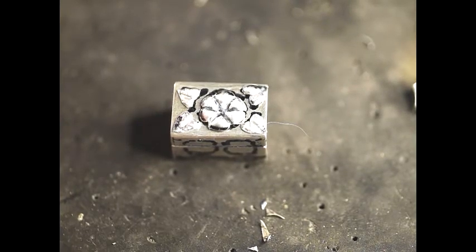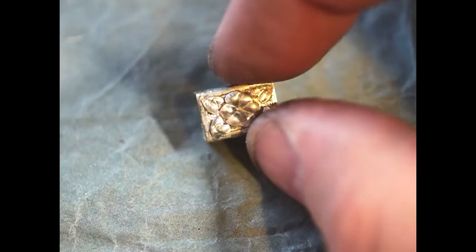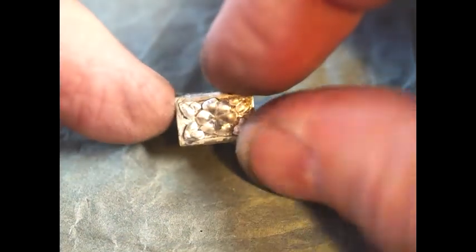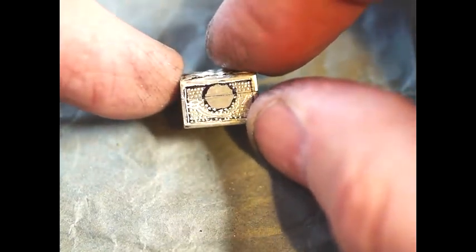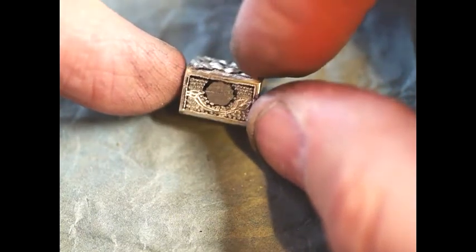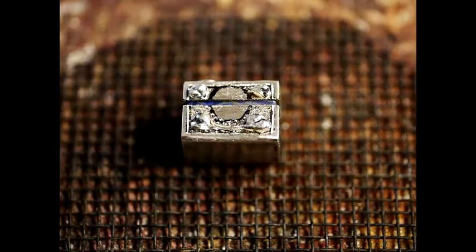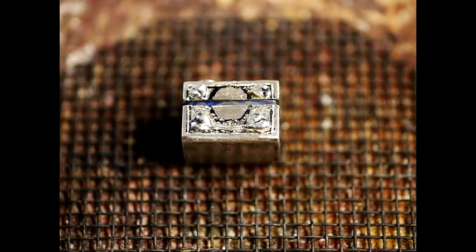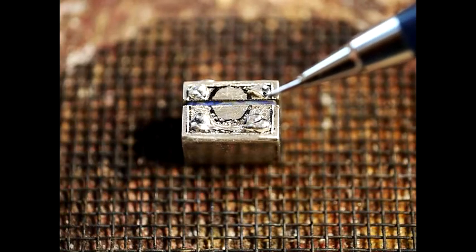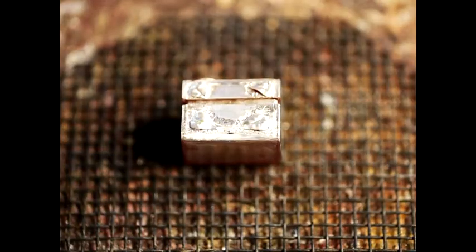The pieces are finished, laid out, and cut out with the nail scissors — it gives you an idea of what it's going to look like when it's finally done. Here's the little silver box now: it's had the repoussé decoration added to the top, soldered on with easy solder, and there's been a bit of engraving done on the front. What you see is called dot relief, and it provides a background to the leaves that are going to go onto the front. You can see the repoussé leaves which have been added with solder paste underneath them — there are actually four — and the box has been just separated to avoid any sticking so the lid doesn't end up stuck.